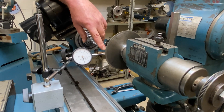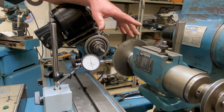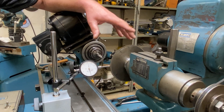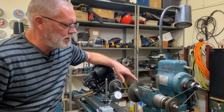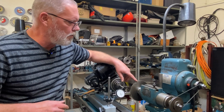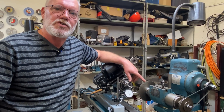I've dialed my wheel in, and that's important because the wheel spacers aren't a press fit — everything's kind of loose. You don't want to press grinding wheels onto things; it would matter less with steel ones but we still don't do it. So I dial my wheel in so that one side isn't slapping away at the workpiece — this way the whole thing will more or less be contacting the workpiece evenly, and it'll keep my wheel round as well.